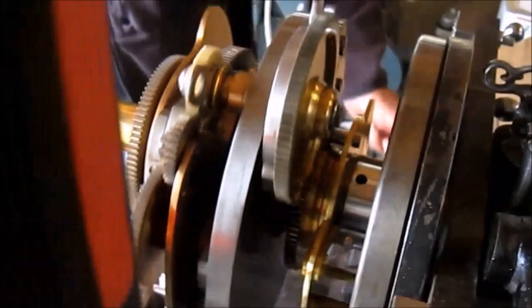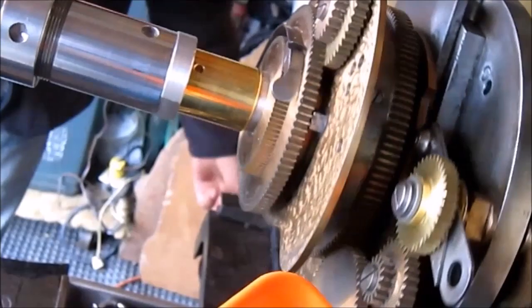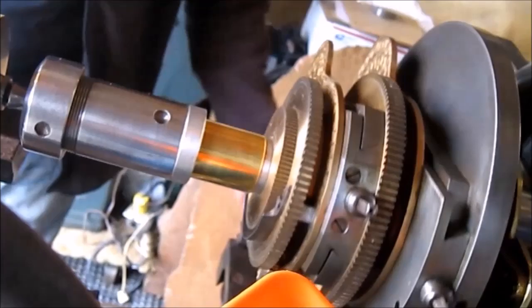And it's hard to see right now, but is that cross slide moving back and forth on the chuck? No, it's not. It's fixed at the diameter that I want. I've got it out over here. Can you see the first stage? I have it out 11 cranks, I believe. Okay, it's 11 turns out, and that's to get the diameter I want on the pattern.